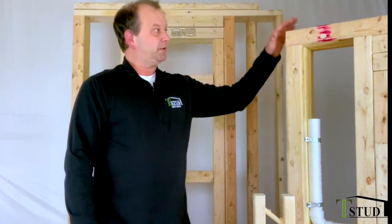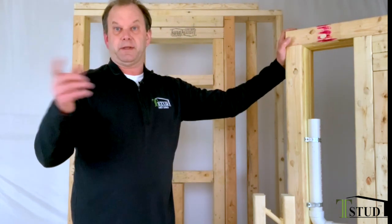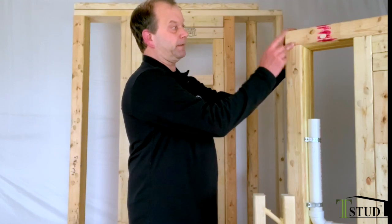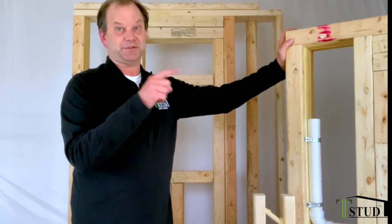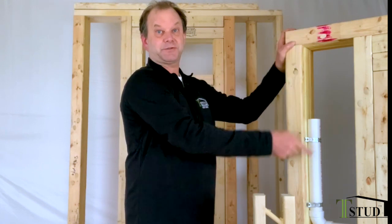The T-Stud wall assembly uses the T-Stud for the top and bottom plate. You're going to have to cut your studs a half inch shorter because a T-Stud top plate and a T-Stud bottom plate are a half inch taller. We're not going to ship out a whole other set of SKUs for stud lengths that are a half inch shorter — so I'll apologize in advance. Cut them a half inch shorter, or your wall assembly is going to end up being an inch taller because your studs come out at 92 and 5/8, or 104 and 5/8, or 116 and 5/8, plus the T-Stud top and bottom plate adds an extra half inch.